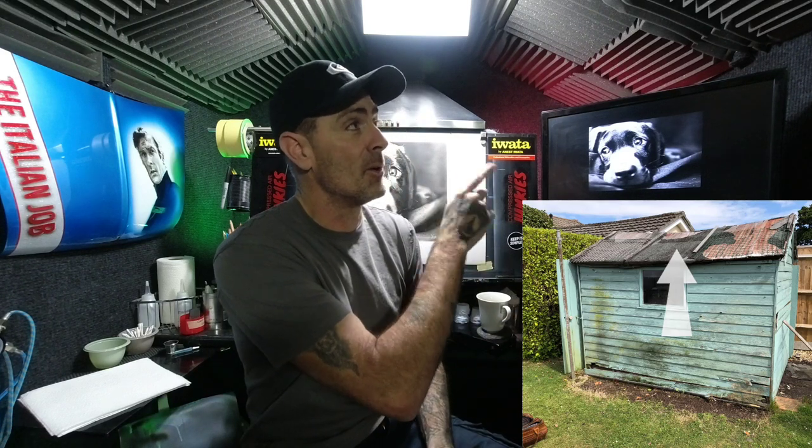I moved to the inside and panelled it all in OSB. It's fully insulated - floors, walls, and roof. I redid the roof because on eight by six sheds the roof starts to sag over time, so I put an extra four struts across - usually you only get one in the middle - and then laid 18mm OSB board over the top to really strengthen the roof.